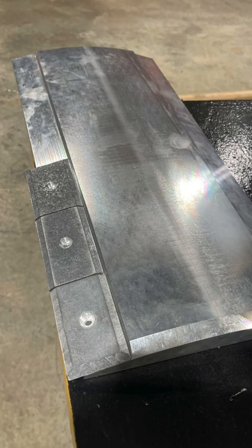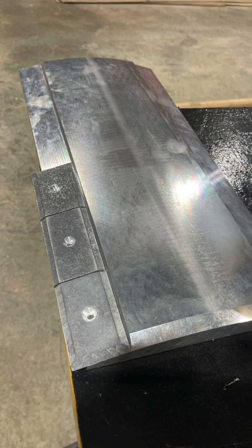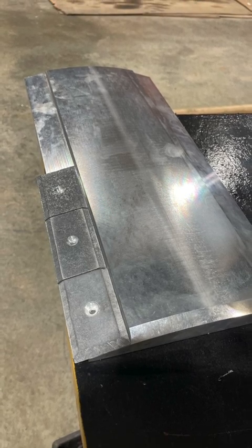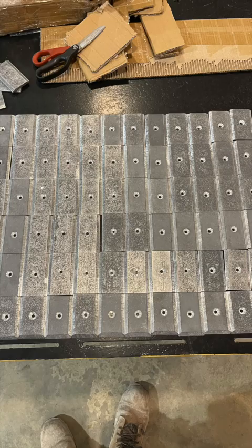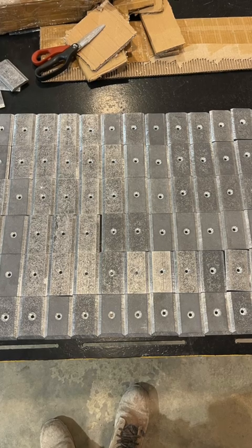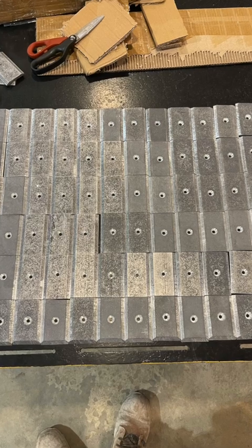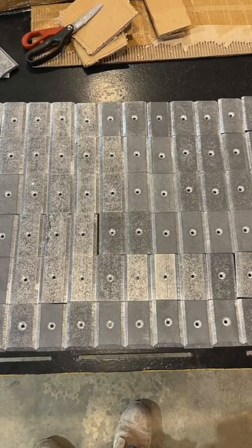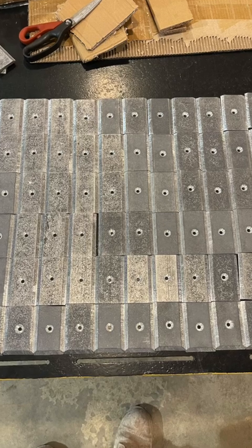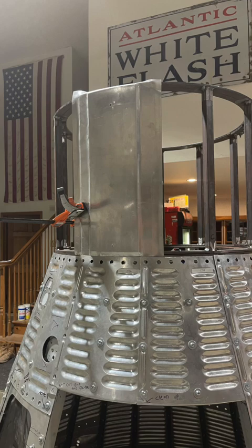This other die is the recovery section panel die — I had that manufactured. These are all the little washers. This was a two-inch by quarter-inch aluminum stock, which I routed and cut down into 72 of these little washers.